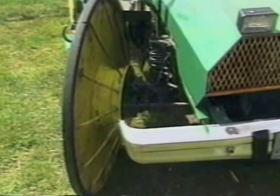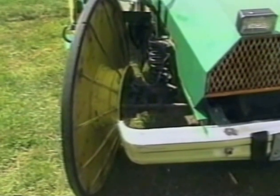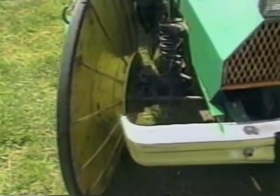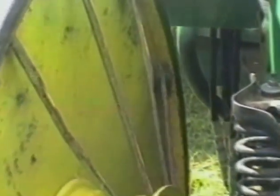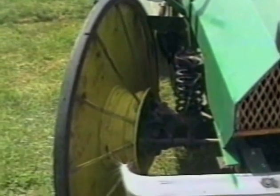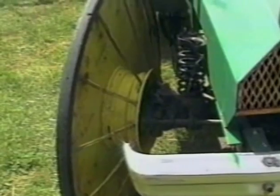Here we see the configuration of the wheels. We took off the tires and used 11-gauge black metal that came in four-by-eight sheets. We used the 48 inches and made a circle, welded to the outside with spokes to the other side. I made them too light to start with and had to beef them up a little bit, but that can be handled. The two-inch hard buggy rubber was put on at the local buggy shop.